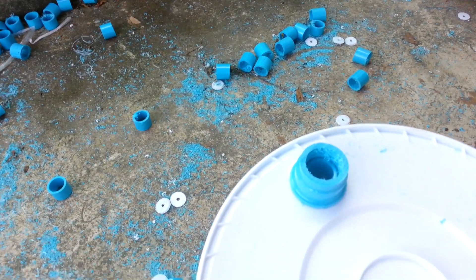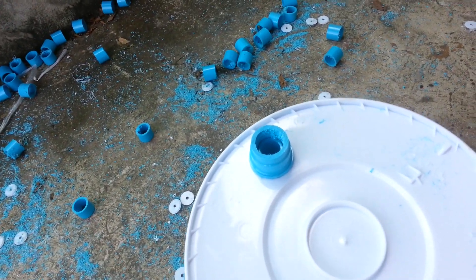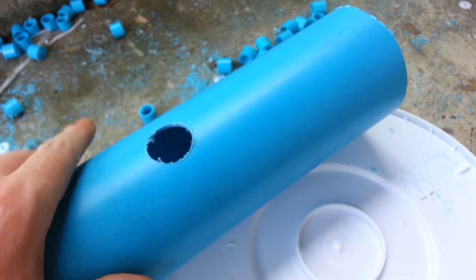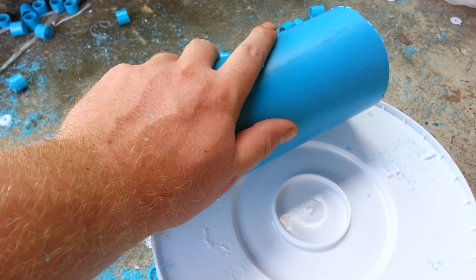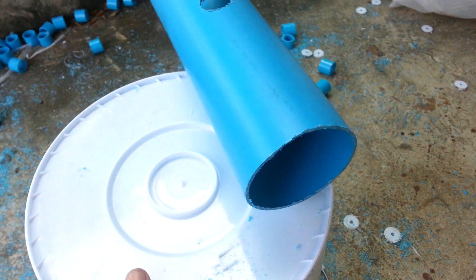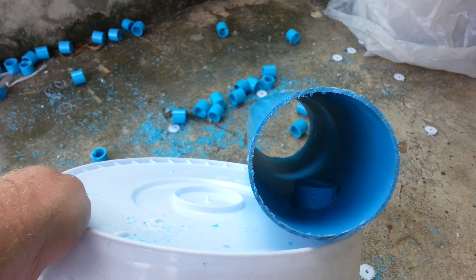Here's why. I'm using three-inch drain holes, so they're going to sit in sequence. You can imagine about 90 of these buckets all draining into this three-inch line. I didn't want all of the volume of the pipe being taken up — the additional volume being taken up by the drain.